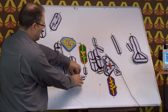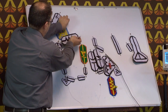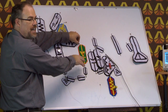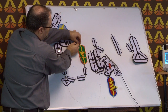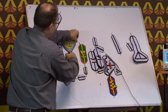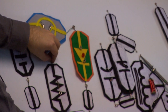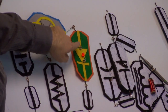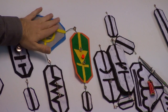So if I take this same 1K, this traffic jam, right, and I were to use it to power the LED directly, it's turning on, but you probably can't see it, right? So the difference between that amount of light, which is just enough that I can barely see it. Does anybody want to come up and look if they doubt us? Or no, it is turning on. Even if you don't doubt us, if you just want to affirm to everybody else. But right, if I now turn it on with this, that's roughly the same amount of electricity going through there. But for every one electron that gets through there, I'm getting a lot more electrons that pass through the switch.